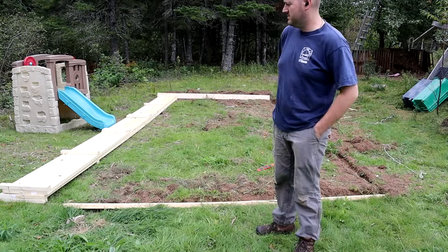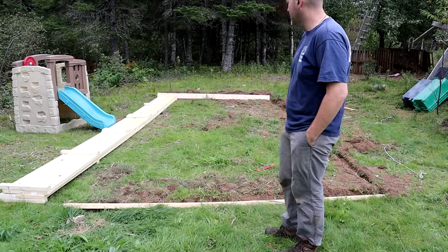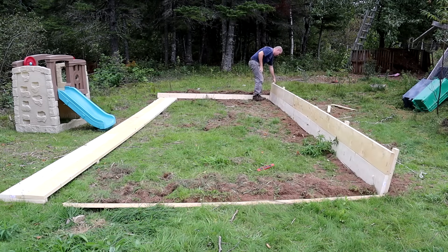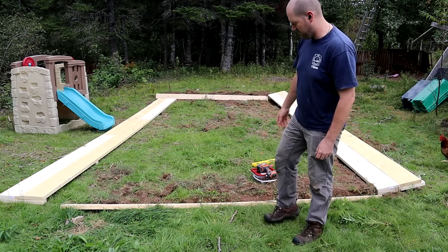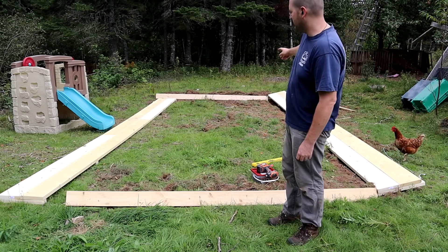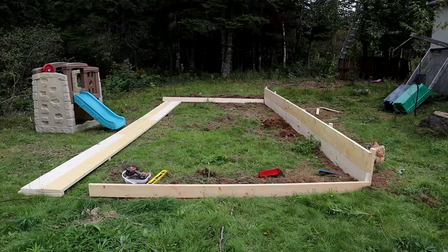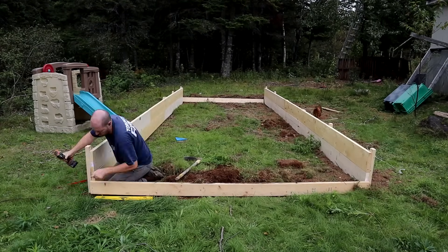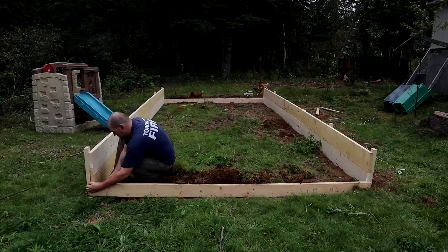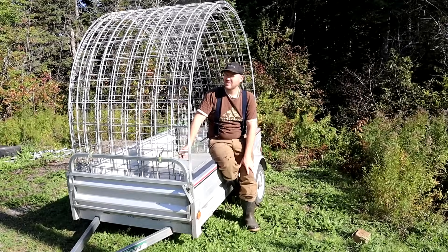It's the next day. I got the two sidewalls finished — had to stay till after dark. I don't know if the time lapse came out or not. So I'm going to attach the 2x6 by 10 across the bottom of the front and back of the walls. The next step will be the cattle panels, then building the end walls, then plastic it in, and it's finished.